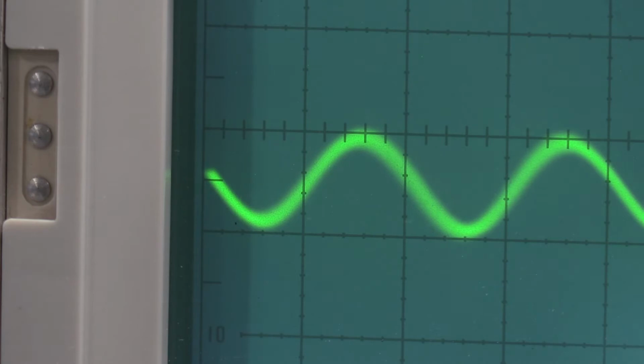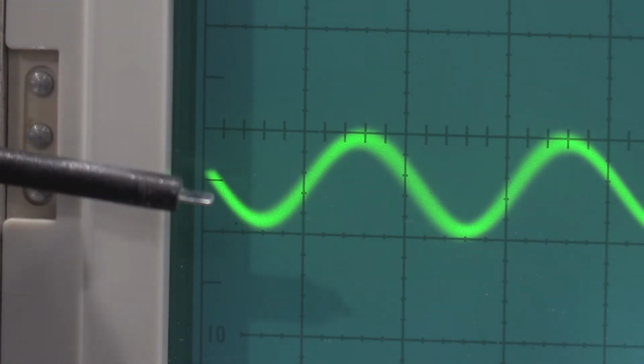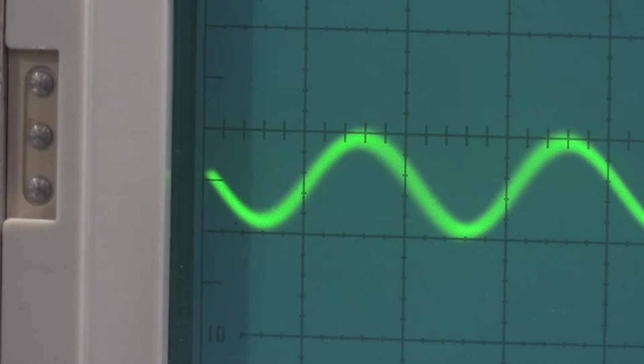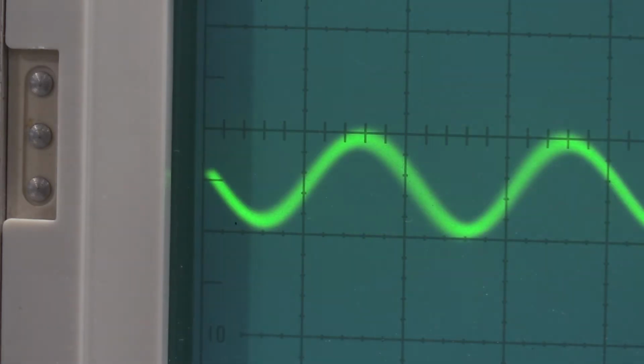Okay, we still have an established electrical center on the CRT, which on this CRT is this main graticule line right here. The delay trigger is set up to 10 microseconds, and if I switch the polarity, we have it triggering equidistant between the top and bottom, so that looks good there. So that will finish up adjustment number 2. And we're on to adjustment number 3.